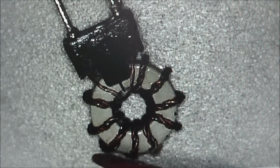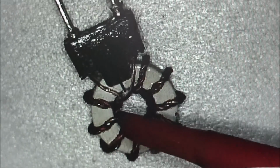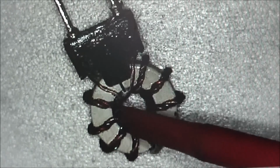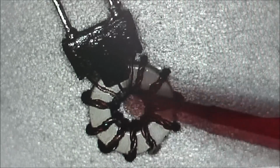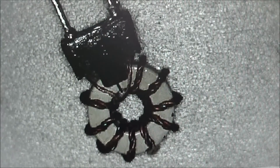So the green wire is supposed to come out and come over to this edge of the pin here. As you can see, it's broken right next to it. I tried to pull it out a little bit to see if I could get it soldered, but these wires are coated, so it won't be possible without unsoldering everything and pulling it out. So replacing it is probably the best option.